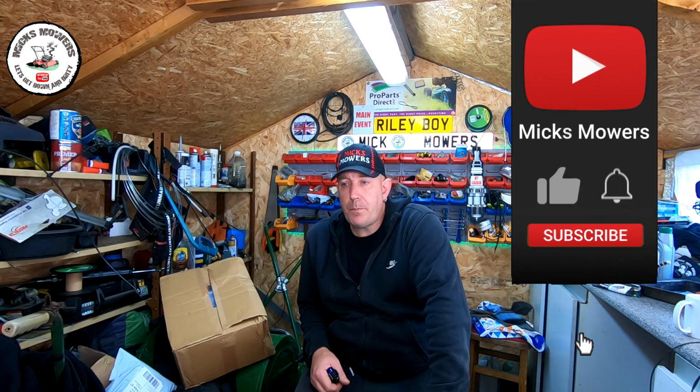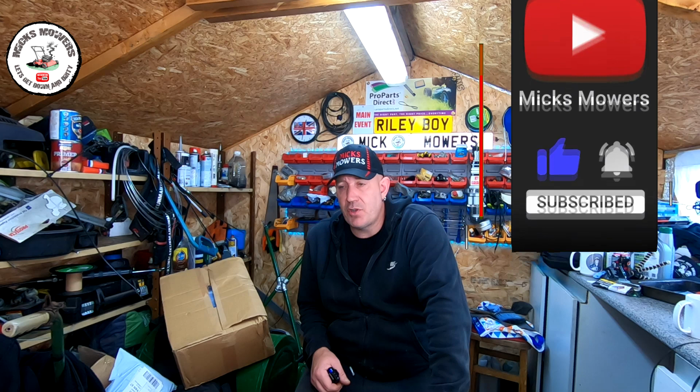So what I'm going to do is clear the deck stand out of the way and get the Dennis outside, which is no easy task in itself because it is such a big machine. Get the Dennis out onto the lawn and just show you what I've been doing. I've got a few little fuel leaks off the carburetor. Just need to have new gaskets put on, little fiber washers. That's no biggie, I can come back to that. It is only weeping, so it's not a problem.